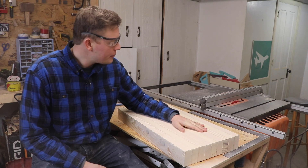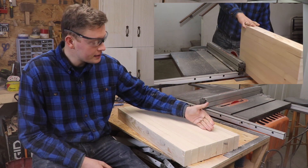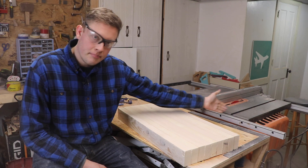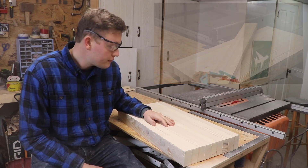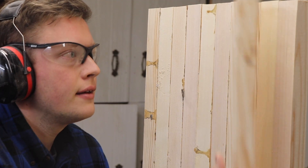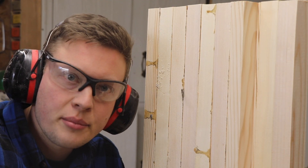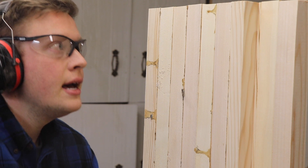With the surface now flattened to my liking, I'm going to take this to my table saw and cut out about three and a quarter to three and a half inches from the back side so I can accommodate for that bump-out for the motor casing on my particular table saw. Yours may be the same or different — either way, I'm just making a very simple modification. Now that that notch is taken care of, I'm going to cut this to its final length of 27 inches between the front and back rail, and then do a round-over on the tops of both ends — those are the rail-facing ends as opposed to the sides going against the table saw or the vise.